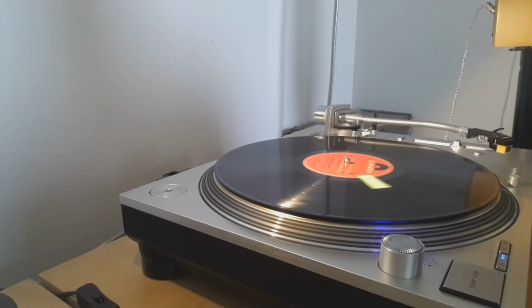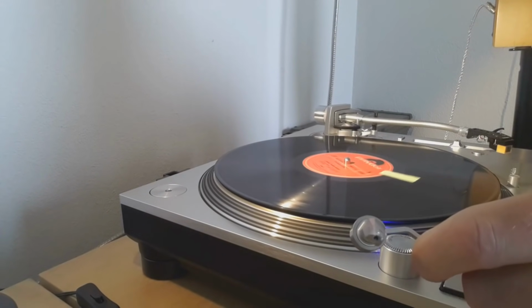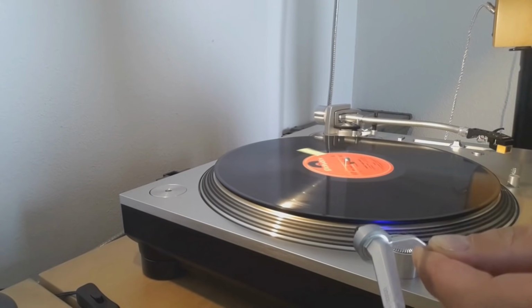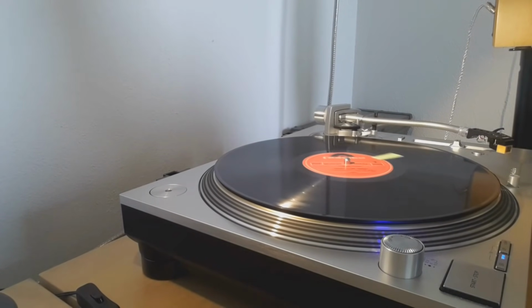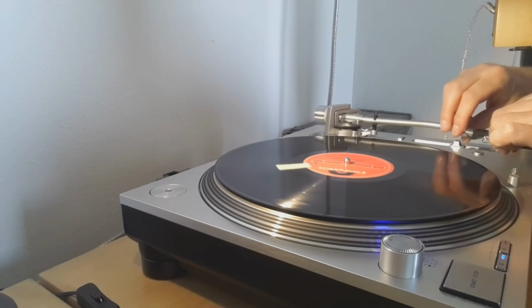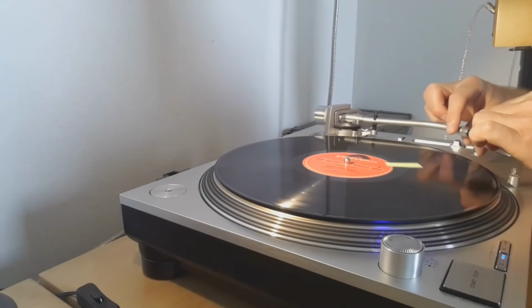So now the next step is, as we have to make a new groove, just put a little bit more force on the needle. I don't usually use this needle, but I switch to a DJ cartridge. And a DJ cartridge has the advantage that they run at approximately 4 grams, or you can even put them a little higher. So we will do that now. So we will remove this cartridge. Be careful, of course, that you don't hurt your stylus.